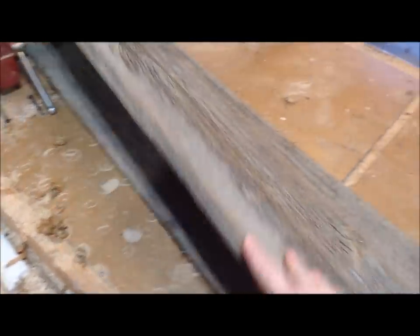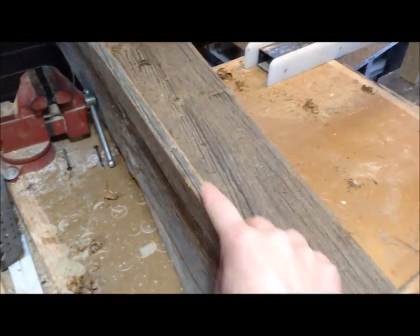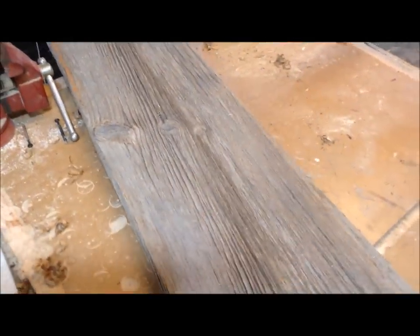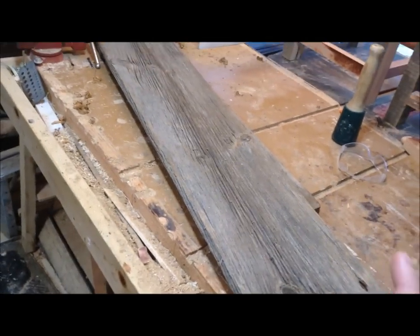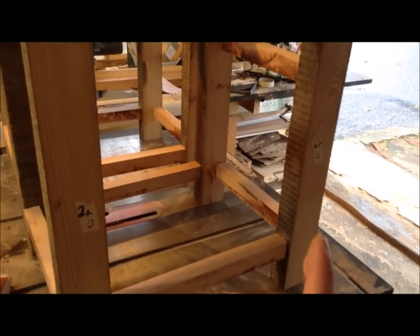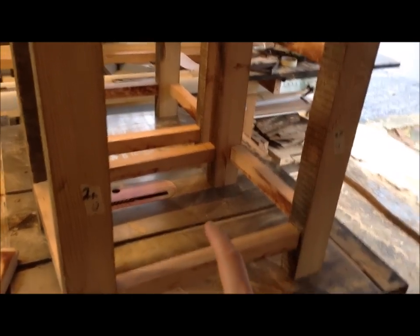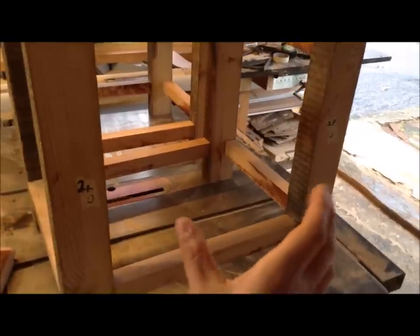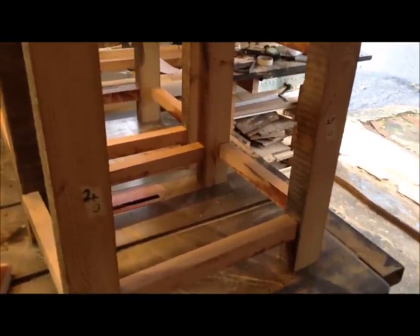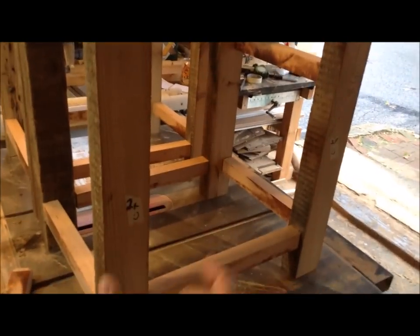Because over the years these weathered differently, the edges are thicker or thinner depending on what part they fall on the piece - about five-eighths of an inch on one side but about a half inch on the other. I'm going to cut a five-eighths-of-an-inch groove on both sides around the whole piece. You want those panels to float in there, similarly to how you'd make a door - seasonal temperature changes and humidity will cause this to expand and contract. If the panels float and aren't glued in place, they can move freely, won't crack, and the whole piece will be more structural.